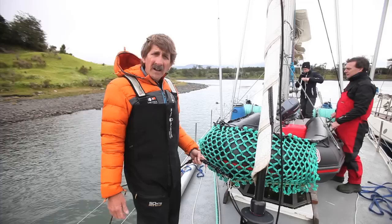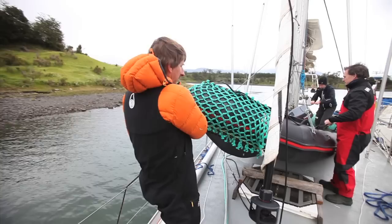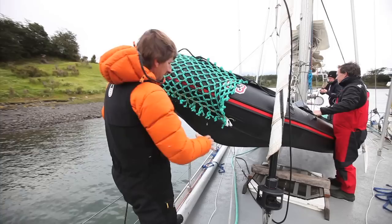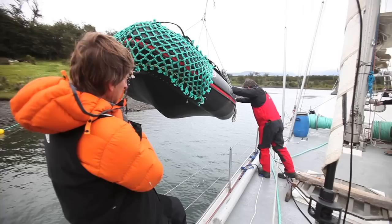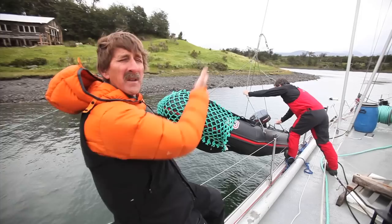We're going to hoist this thing up and get it over the side now. It's very important to have the bow line attached to the boat. In high winds, the bow line will tend to sky up and you want somebody holding the bow down. Jonathan's going to push it out over the side and try to control the whole thing so it doesn't blow all over the place. Everything you want — your dinghy kit, anchor, oars, paddles, fuel tank — should be prepared and inside before you go up over the deck and into the water. You don't want to be handing things down, especially in a rough sea.